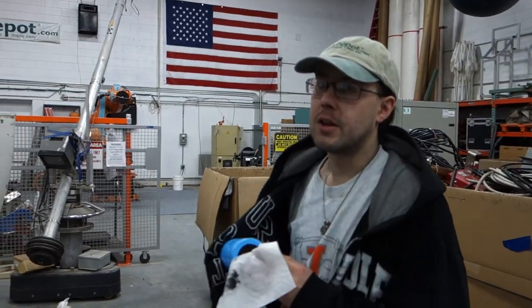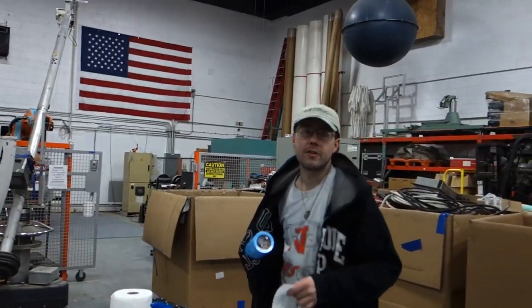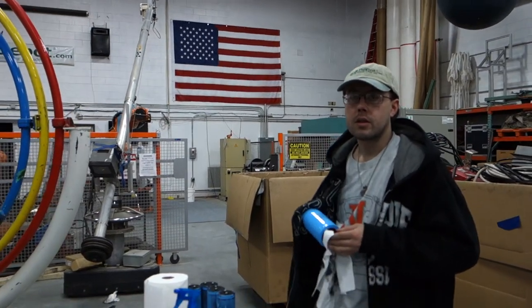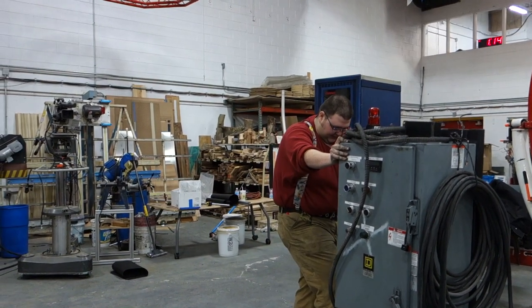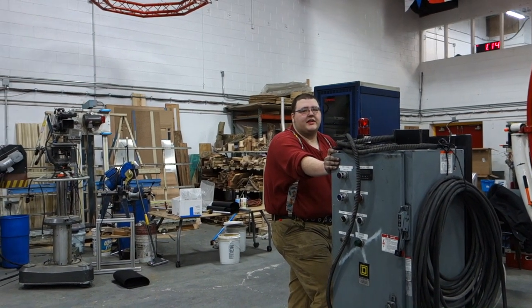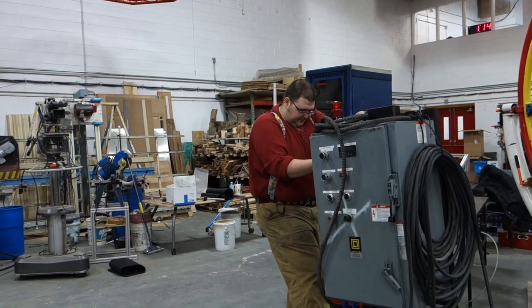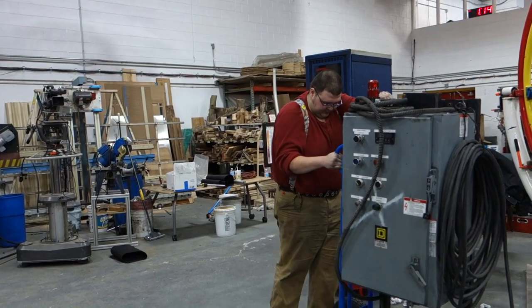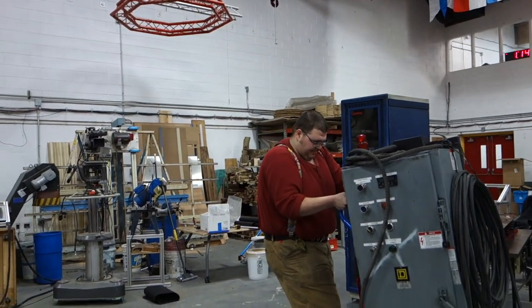Some point, that's gonna get a whole new thing. Did you just use an electrical flex? Yeah, I'm not gonna use regular metallic BX. I'm gonna use non-metallic, the gray plastic stuff. You know what looks sexy would be that bright orange stuff. Yeah, but it's the stuff for running fiber through. Oh, the split loom for fiber? Yeah, I don't think it's tough enough. Probably not, but it would look cool. It'd look cool, but it cracks easy. What we can do is get a thing of gray, non-metallic armored cable, and we can spray paint it or wrap it in something. Wrap it in orange electrical tape, that's doable.